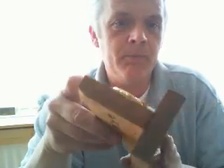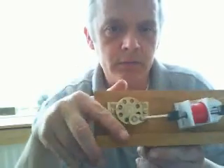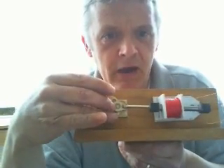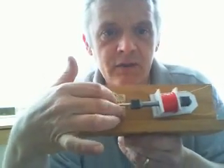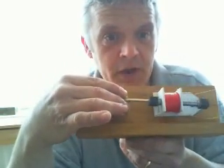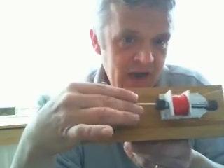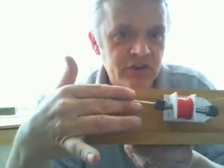My idea was to put a flywheel on the back — a relatively large flywheel. Then what to do was to pulse this with a higher voltage so that it would be shooting up there, and the stored mechanical energy in the flywheel would bring it back down again. If I have a micro switch here, then it will hit the switch, which will pulse it and bring it back up. Once it hits the flywheel, it will carry it around back down to its position, hit the switch again, and so on — giving us this reciprocating action.